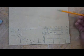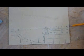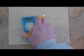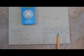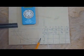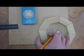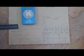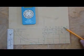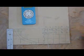Starting with the beginning, D is diameter, of course. The length here we'll discuss in just a second, then width, thickness, and total length. The way that breaks down is just like this. We start with our 10 1/8 inch diameter. For our width, I usually go ahead and do width and save length for the ending. For our width, what you want to do is measure the width of our little rectangle here, and in this case, that's going to be 3/4 of an inch. Again, that relates to the width of the stock that you need to cut. T is thickness, of course, which is going to be about 3/8 when it's finished. I wrote down 1/2 inch, and that's just for me because I'm going to start with 1/2 inch, and by the time I get it all cleaned up, I'll arrive at my 3/8 final thickness.